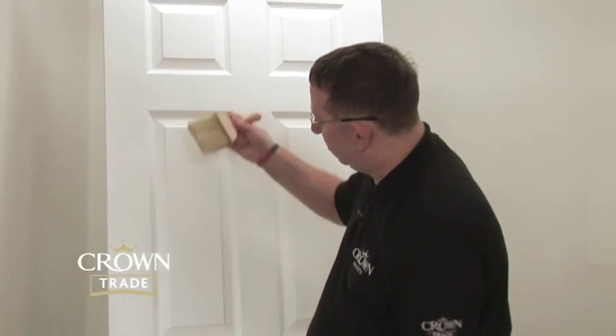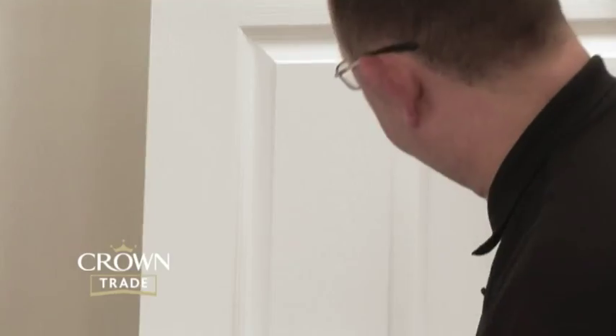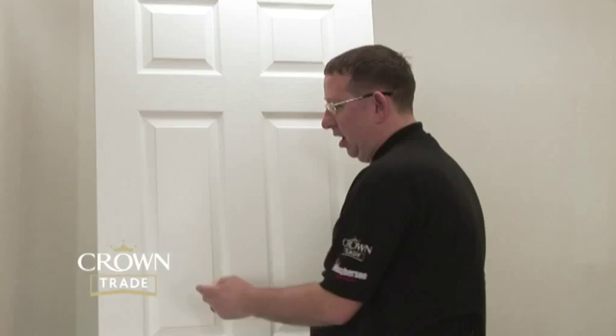After sanding, we take a dusty brush and dust off the surface. Alternatively, you can use a tack rag, which is slightly sticky, and when you put that onto the surface it takes the excess dust off. The surface is then ready for receiving a coat of the acrylic gloss or the acrylic satin finish.